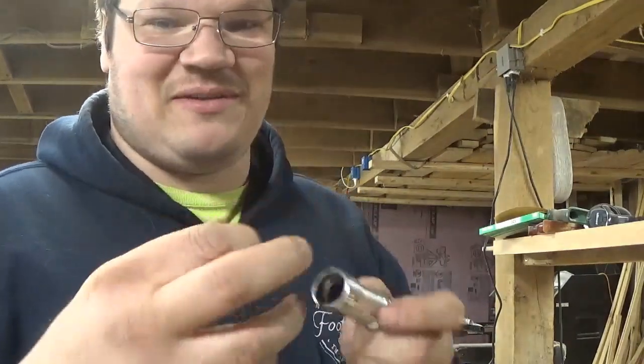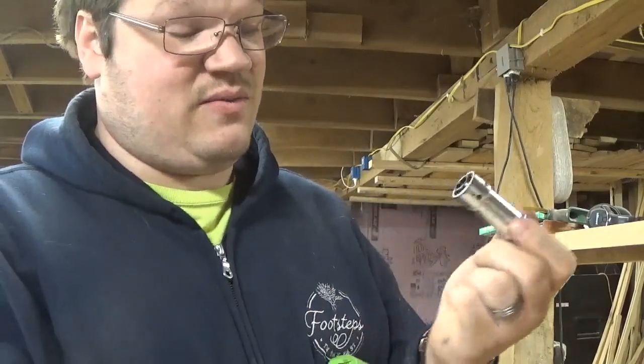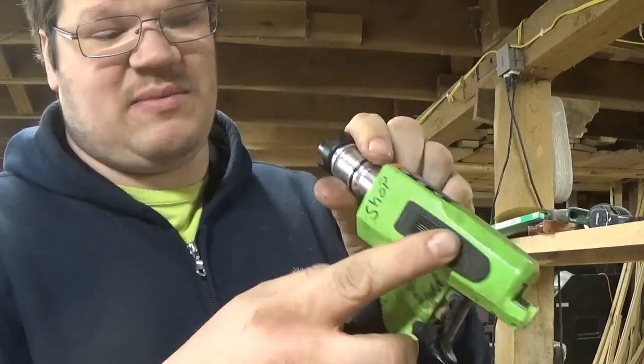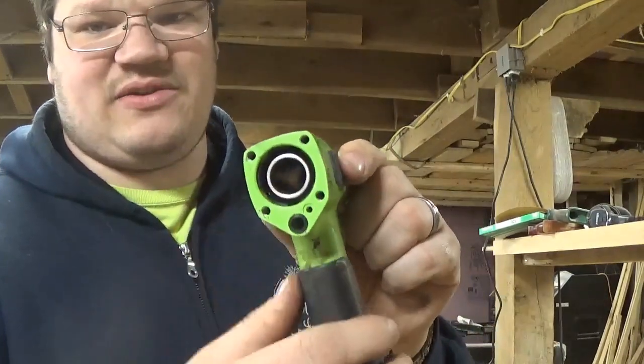Okay, so the grommet, this is the bottom of the cylinder. We're going to put it into the cylinder on the bottom. Then we can replace this cylinder into the gun, keeping what looks like the castle nut in, and then you should be able to push that down. Yep, just wiggle around, push that down in there until it seats back into there.